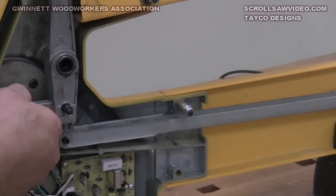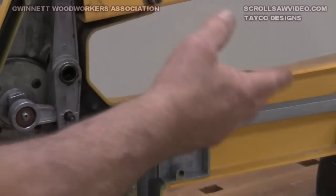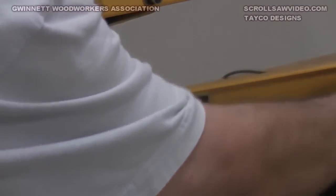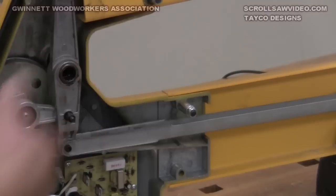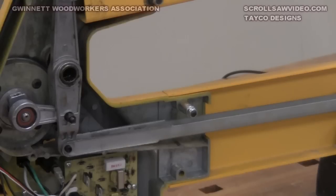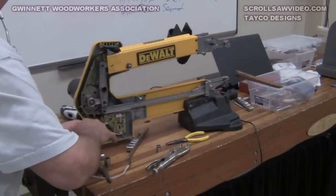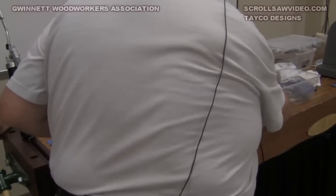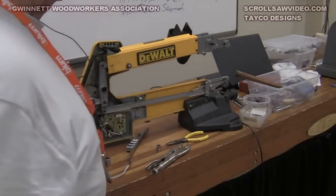This is what you have to do to start disassembling the rest of the machine — you've got to take that apart so you can get this arm off and get this whole linkage going. What I'd recommend is getting up here and taking these assemblies off and releasing the connecting linkage so we've got fewer parts to deal with. When you're working on an assembly like this, use good assembly practices: put any parts you take off in a container so if something falls, you're only looking for tools instead of parts.